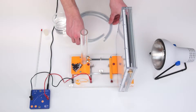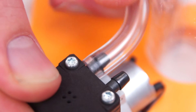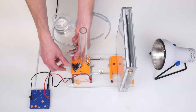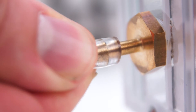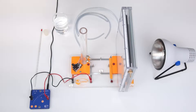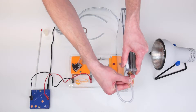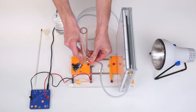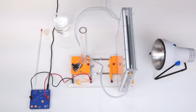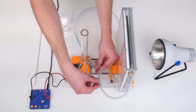The power module is connected to the pump above the metal strips on the base unit. Now we have to connect the components with each other through the tubes. It is important to note that the right connection of the pump is the pump output and this is connected to the lower hose input on the collector. This best ensures that during subsequent pumping no air is left in the water cycle. The upper connection of the solar collector is then connected to the upper port on the balancing container.